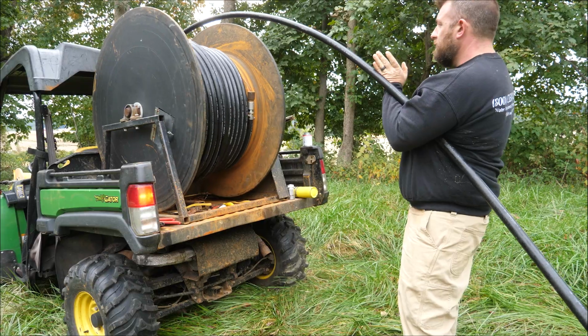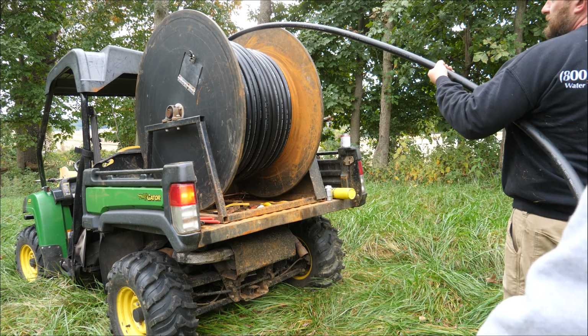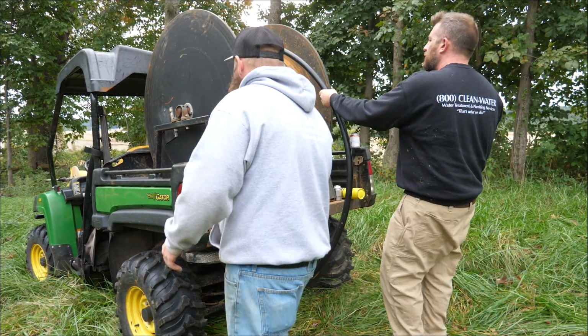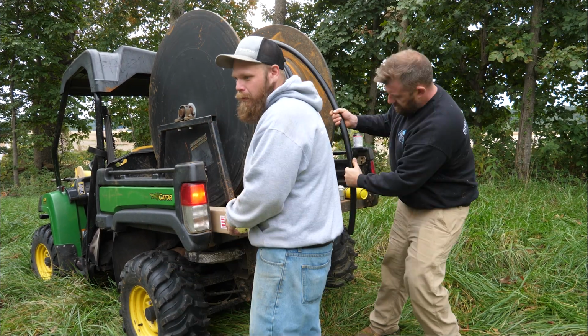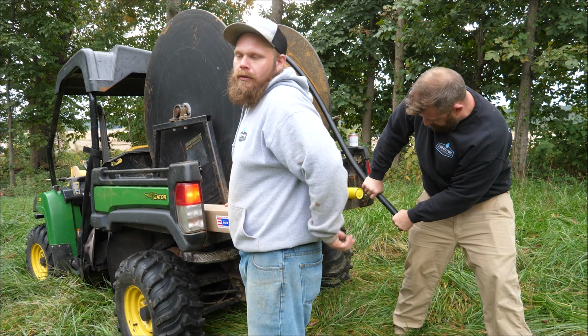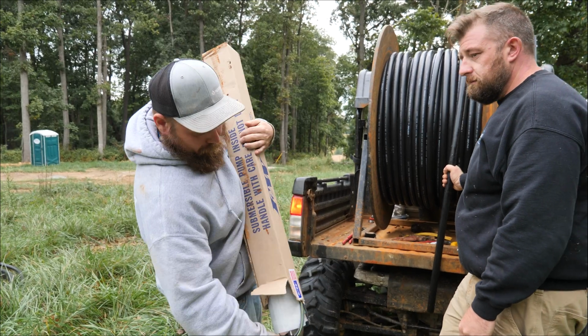Gotcha. You brought a 3/4 horsepower pump, right? Is that what you want in the hole? Yep. Okay. The driller recommended 3/4 and I think that's what Kevin and I settled on as well. For the depth, I think it's what makes sense. Me and Dennis were talking about it. You could go either way, 3/4 or half. Gotcha. Yeah, we'll go 3/4. That's a lot longer than I was expecting it to be.